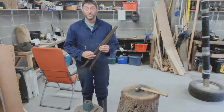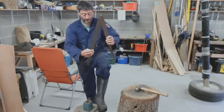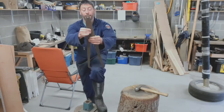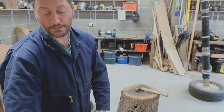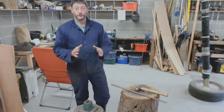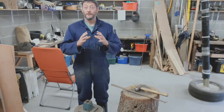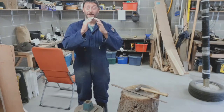Going to do measuring the knees with my dividers. Put that across there. Hold it firm so it doesn't move. Measure it down there. That's 3¾ inches. So if I then allow 1/4 inch for the lames, which will fit on the inside of the knee, and then allow a half inch of padding for each side, that means that my shell needs to be 5 inches across in the middle.